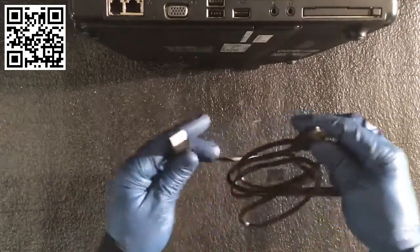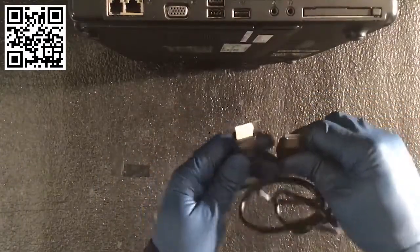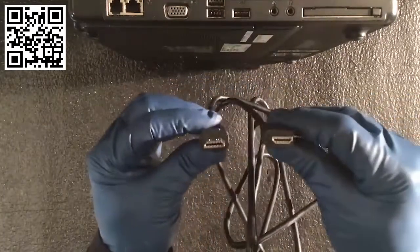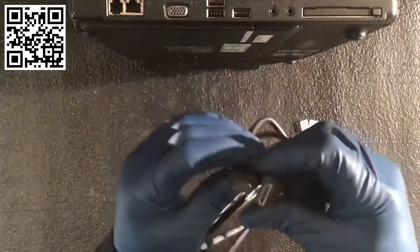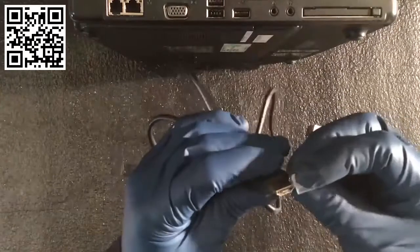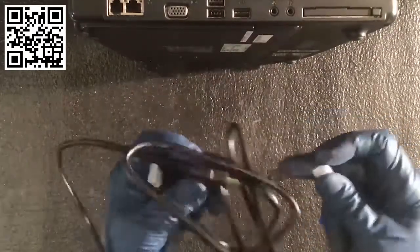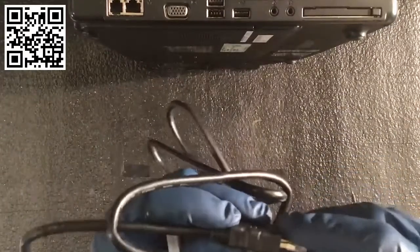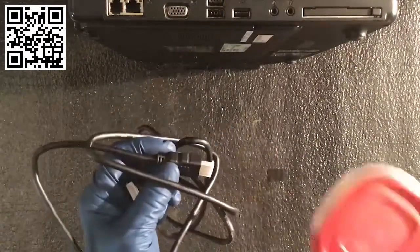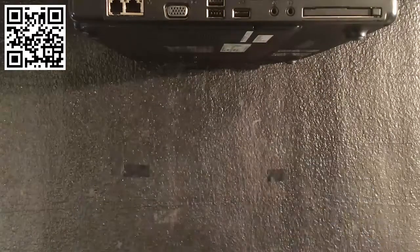This is your common HDMI cable — it stands for High Definition Multimedia Interface. It's a 19-pin connection. These are the caps that connect it. When putting this back in the toolkit, I like to keep it neat and organized. Keeping these connection caps on prevents spiders, dust, and debris. Always replace these caps rather than throwing them away — save them in a handy container for after you've installed this at a customer's place of work.